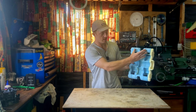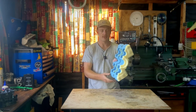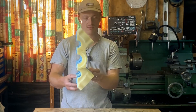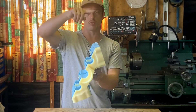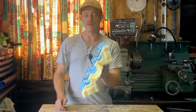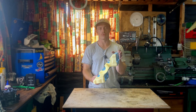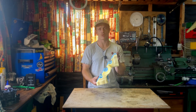The plan is to run two gates from top to bottom. It's going to be placed in the sand probably something like this, or maybe like this. It's going to be poured from the top with about 150 millimeters of sprue, and then I'm going to have a large pouring basin — probably about 25 to 30 percent the volume of the part — so once I start pouring I can keep up with the pour.